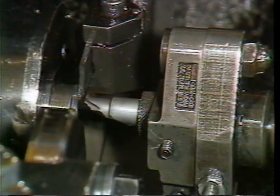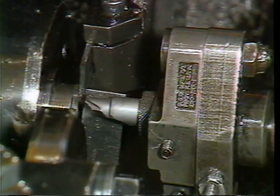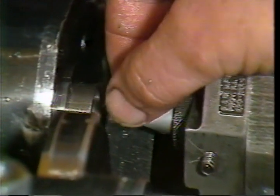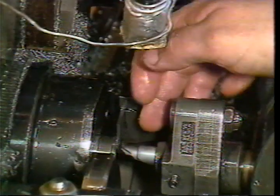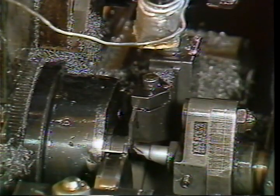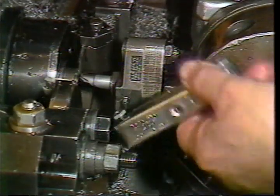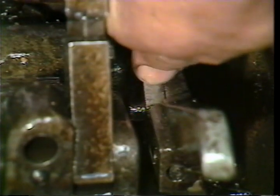You can now set the location of cut. Measure from the edge of the cutoff blade to the tool. You must also center the tool — use the cutoff blade as reference. The cutting edges of both tools should be parallel. When the recess tool is properly centered, lock the tool down securely.